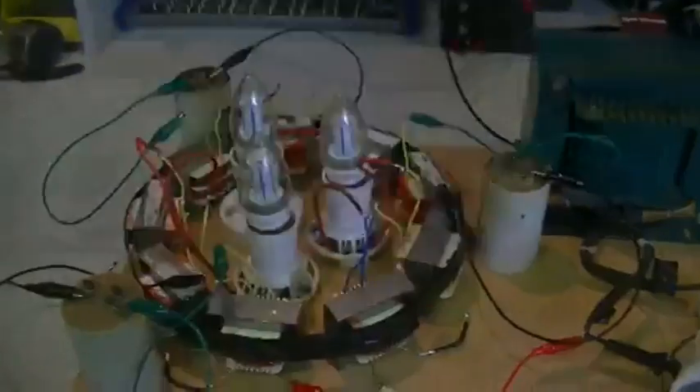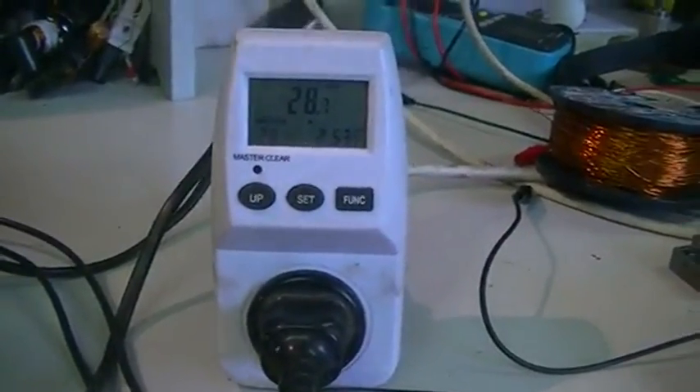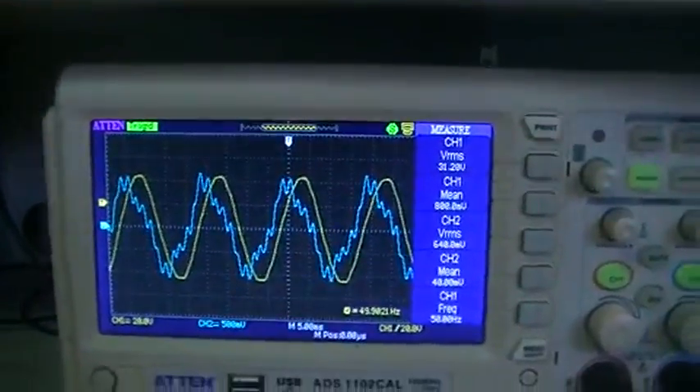And now we have a disco, and we are now drawing 28.4 watts. I'm not really sure why they're flashing like that — I would think it would have something to do with the circuit inside the LED itself, and perhaps the two secondaries hooked in series on each pair of transformers going to the light is not enough power to get them running full time, but they're building up a charge in the circuit and then bang, letting it all go through. And as you can see now, the current is lagging behind the voltage, so slightly, and it's also very messy.